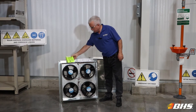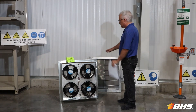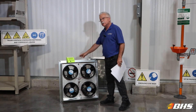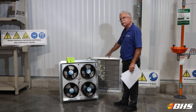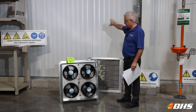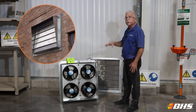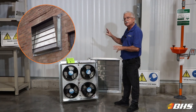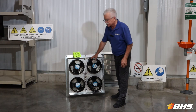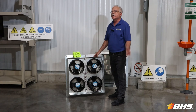There's another option available in regards to hydrogen gas. The hydrogen exhaust fan, coupled with the HGD, will be an all-inclusive kit for you. This will be affixed to the exterior wall of your facility. On the outside there will be a weather louver to prevent any escape of domestic air, or vice versa. The hydrogen exhaust fan kit also includes an exhaust fan circuit and includes redundancy to assure that you're compliant with local fire code.